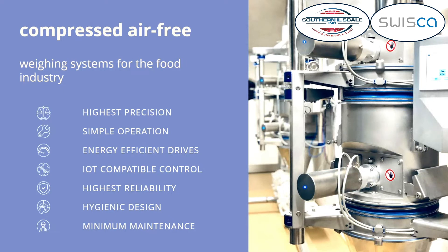Just to summarize: all our scales are compressed-air-free, and they distinguish themselves from many others available on the market in terms of precision and energy efficiency, because they can save a lot of compressed air since we are using servo drives, and they are all stainless steel. They are all very good when it comes to cleaning — there are openings that give access to the inside, even to the bin or the weighing hopper. It can be cleaned if needed, and it's connected to a modern PLC system with a modern scale control that offers all the individual interfaces needed today.